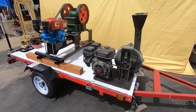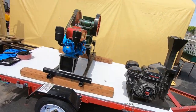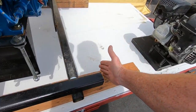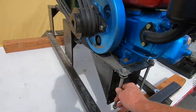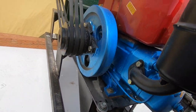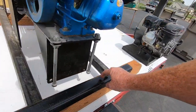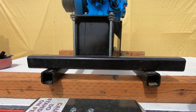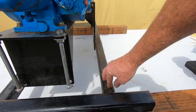I'm thinking about the positioning still - if I exactly want that guy just like there or whatever. I think I'm going to trim these guys off a smidge so they're not sticking out so far. This here is going to be the adjustment for the belt tension. Remember, as we lower this down it's going to torque the belt. I'm basically going to weld these guys right to the top of here, but I've got to cut them off first - you can see they're a smidge long. I'm going to zap those off and then weld them right to the top, right underneath here.